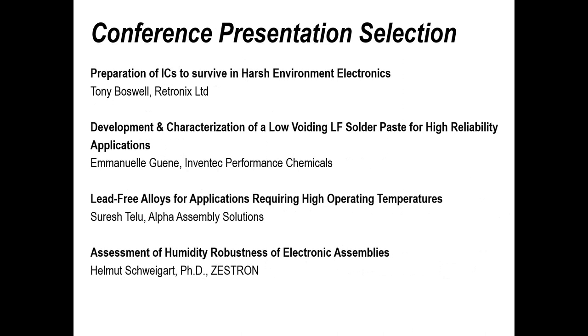Another presentation covers alternative solder materials. Tin-silver, tin-antimony, and HMP solders are alternatives widely used in the industry for high temperature. High temperature used to mean 150–180°C operating temperature, but now we're moving to 200°C and higher. When you look at temperature cycling of tin-antimony and HMP solders, the joint performance is not necessarily as robust — they will stand up to high temperatures, but temperature cycling can be a problem.